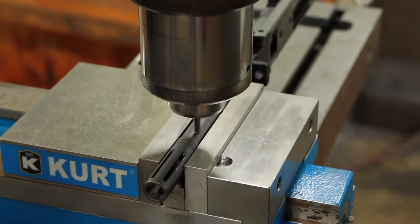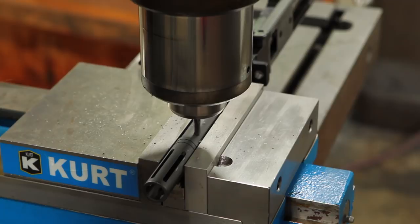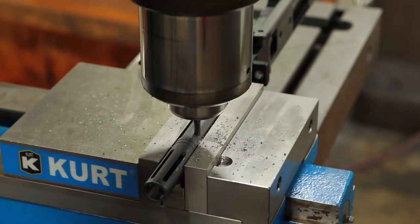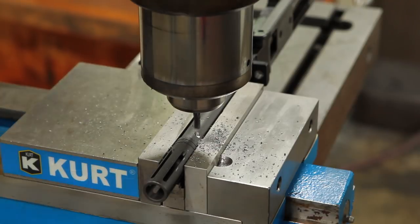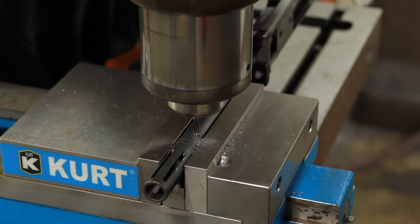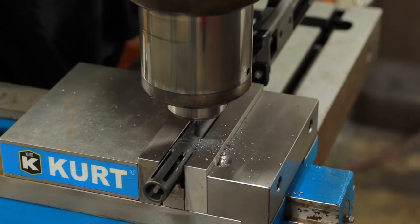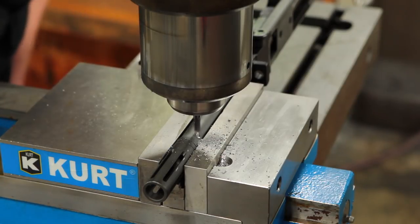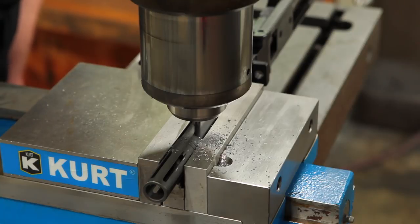Installation of the shroud requires you to remove a blind pin holding the shroud to the factory barrel. A quarter-inch fluted end mill should be used, or a quarter-inch drill bit as an alternative. Hunter Town Arms recommends the end mill over a drill bit because the drill bit can walk off the rounded contours of the barrel. If you use a drill bit, use extreme caution to avoid damaging the factory shroud. Make sure the pin is perpendicular to the mill table and go slowly, checking depth often so you don't drill into the barrel.